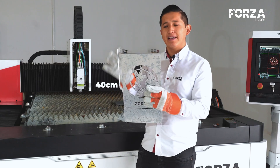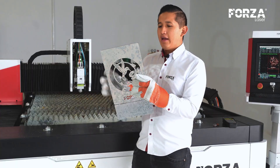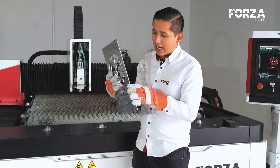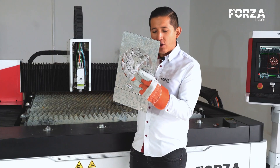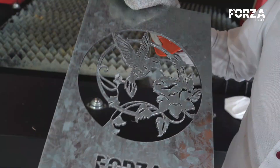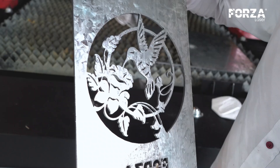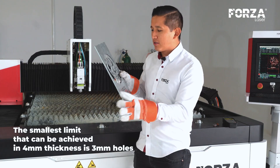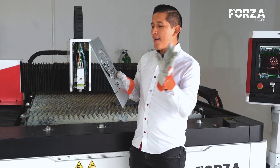Here we have the first 40 centimeters piece of 4mm galvanized steel, and it came out very, very well. But we need to note some differences in the edge finishes. The outer edge has a quite clean finish. However, the inner edges have a different kind of finish — a more melted look. Precisely because in the smaller features, heat concentration starts to occur. Remember, we are using oxygen, and that increases combustion. Basically, the smallest feature I could make on this 4mm plate would be about 3mm, like a 3mm hole. Any smaller than that would become complicated.